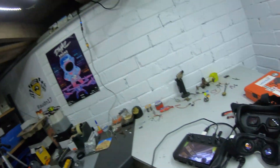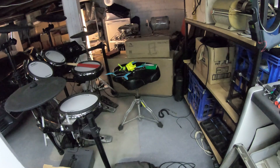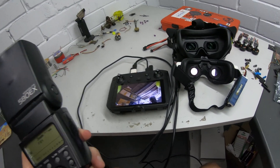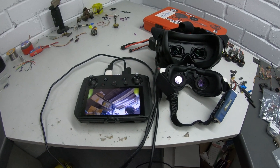Okay, so we've finally set up. We've got all our goggles here and they're all powered up. The screen's powered up and the quad is sitting over on my left with a nice fan to keep it from overheating too much. What we're going to do is use one of these old boys — the old 580 EX Speedlight — and just flash it. When I flash it we will see a flash reflected on the devices as well as the ambience of the room. We measure the difference in time between the actual flash and the flash as it comes through the screens and displays, and that gives us an idea of the latency. I'm also going to put the camera in its highest possible frame rate, which I think is 240fps, so the resolution will go down. Then we'll do a few flashes and see how we go.